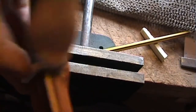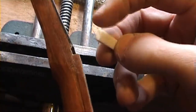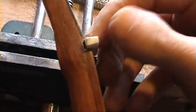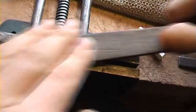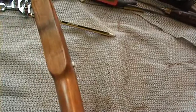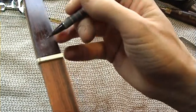Just a fraction of a half a millimetre over there, half a millimetre over there. I'm trying my best to keep it square at this point but slightly beveled on that side. Once I've got it in, I'm going to bevel it again backwards towards the headstock. You can get quite a nice polygon bone. Use a fine pencil to mark on exactly what needs to come off. I don't want to take too much off.